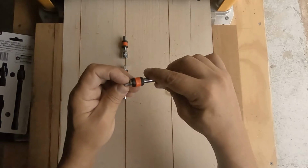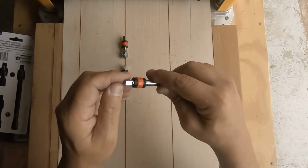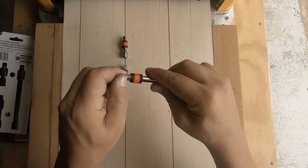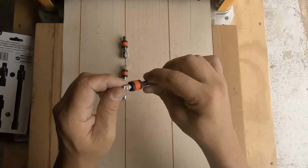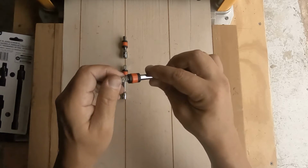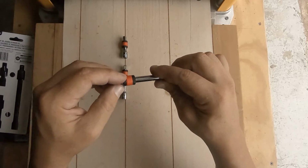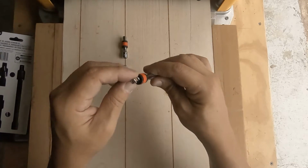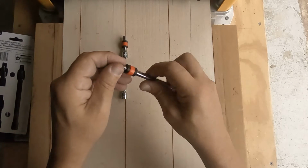And the way these work, so most your extensions, actually before that, I like to look at the machining of the flats. And the reason is, if you see machine marks, that's a sure sign that they didn't take their time to make sure there's no machine marks on it. And I don't see any machine marks at all on these. Now, chances are they just used a die. This was probably pretty much cherry red, and they just crimp it, and they get that perfect square drive. And that way you don't have any machine marks to worry about.